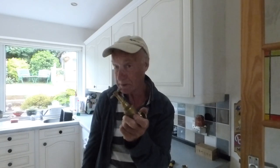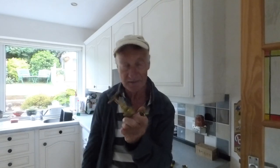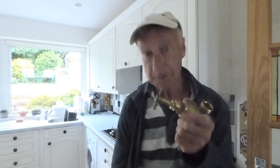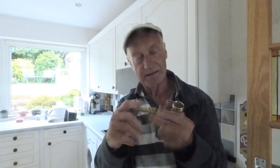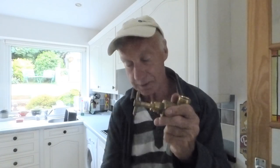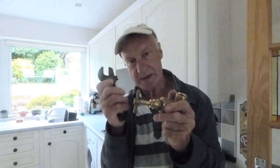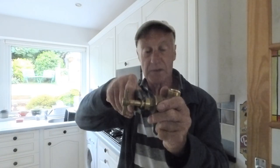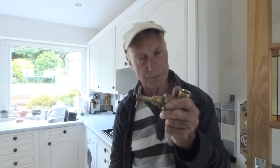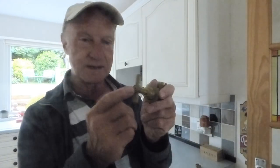This is my preferred way of easing off a tap handle. Not all of them are going to go — sometimes you just can't move them and they've been stiff for so long. Here we have a stopcock. I'm showing you an example with a 22mm one. Normally they're at the back of a cupboard in a very awkward place, usually under a sink somewhere, and they're a devil to get to. Assuming it's solid and you can't move it, first thing to do: get a little spanner and ease off this packing nut. I've already loosened it, but just turn it like so and twist it off a few turns. Don't worry if it starts to weep a little bit — that's quite normal, because you can tighten it up afterwards if we manage to free the thing.